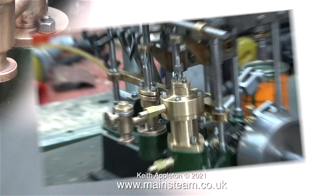Here I'm applying some Loctite 542 thread sealant to seal it, because this is a vacuum pump and I do not want any air leaks. To improve the appearance of the casting in this area — because it did get marked by bits of swarf and the drill bit during the drilling and tapping operation — it's looking good again, and it looks especially good with the parts fitted in place. Many thanks to my friend Ronnie Mall for making them for me.